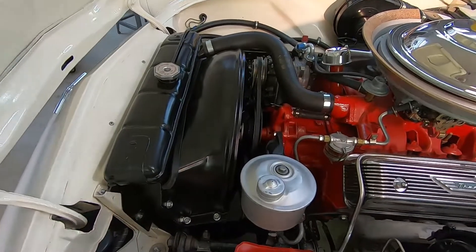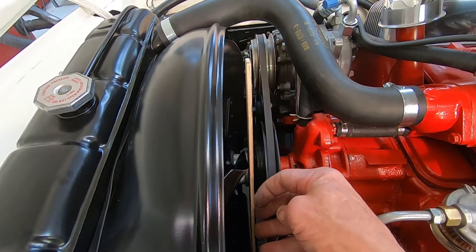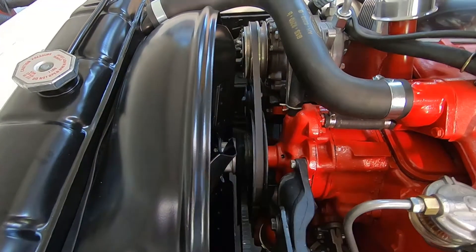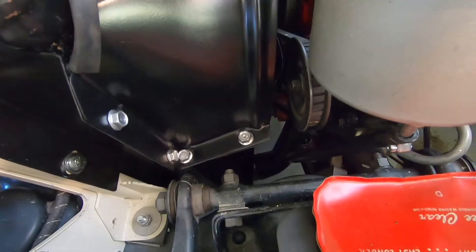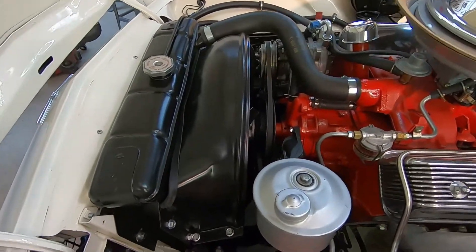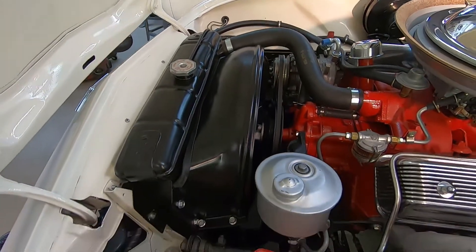It's all back together now. If I put a straight edge across the blades, you can see I've got about seven-eighths of an inch — I put a tape measure on it and it's right on seven-eighths. So that's half the thickness of the fan blade hanging behind the shroud. Down below you can see we've got that new bottom half. And just looking at it at first glance, you really can't tell that the shroud's been modified.